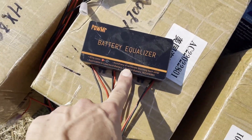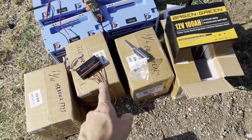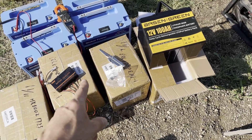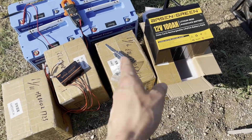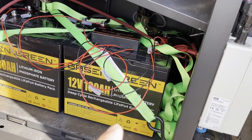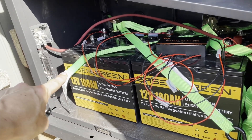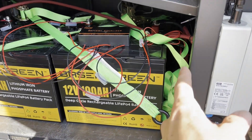While I'm at it, I'm going to go ahead and put this 48 volt battery equalizer in. That's so that if the internal resistance of one of these is higher than another — which is bound to happen — when things get charged up to the highest state of charge, this will balance between the batteries to make sure each of the 12 volt batteries is sitting at, say, 14 volts apiece. The advantage with these Shenzhen Basin batteries is they're much smaller physically — still 100 amp hours — so they fit much easier with a lot of room for wiring.